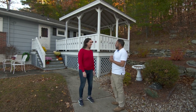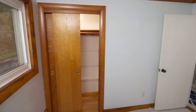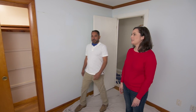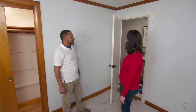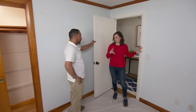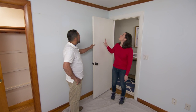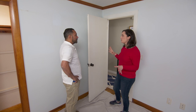Hi Pam, hey Mario — thanks for coming. We've lived in this house four years, it was built in the 1960s, and we've been doing a ton of projects. There's one room I could really use your help with. This is our office — I noticed you have a lot of trim with varnish on it, very common in a 1960s house, and a door that's been painted white. We tried to paint the door and trim using a basic wall latex primer, then two coats of paint, but it didn't cover well and there's some chipping.